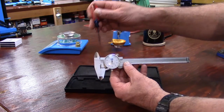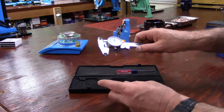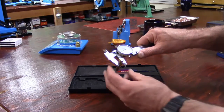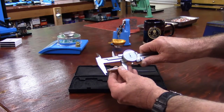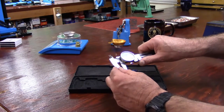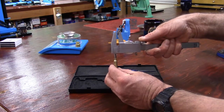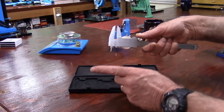The three tools your calipers have are: the large jaws, the small jaws, and the depth gauge. The large jaws make an outside diameter measurement, or a length or width measurement — the externals of an object. The small jaws are for the inside diameter or internal measurements of an object. You won't use the small jaws as often, but they're handy sometimes.